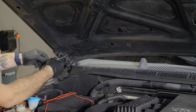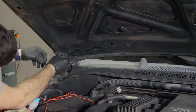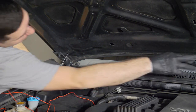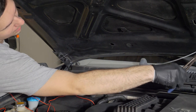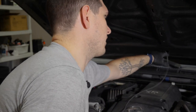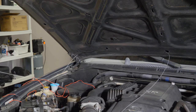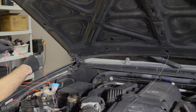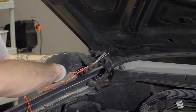I'm going to push the guide cable through here wherever I want to feed my cable. What kind of luck — it literally just fell through the center hole! My plan was to grab some needle nose pliers and grab it, but this literally just popped through. So now that I have the guide cable through both sides, I'm going to attach all four wires to it — just tape them real quick with painter's tape — and then pull them all the way through to the center.